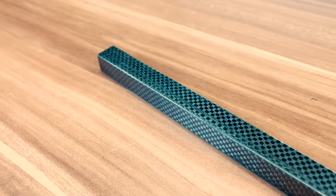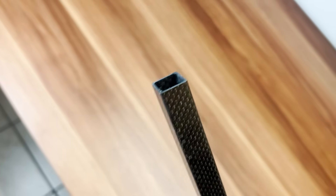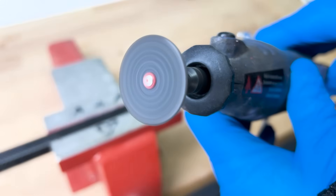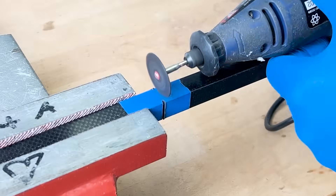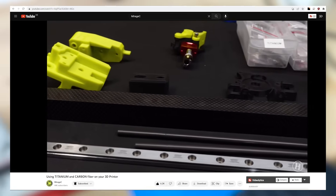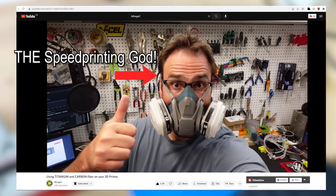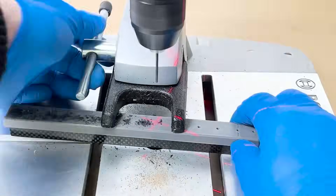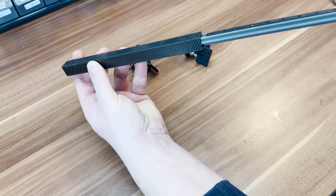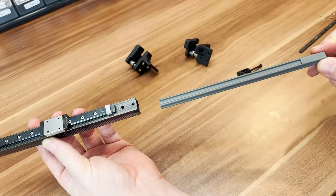When it comes to strength-to-weight or stiffness-to-weight ratio, carbon fiber composites are always worth considering for technical applications. As there is no ready-made commercial option for Voron Zero on the market, I built one myself using a 15x15mm square hollow tube with 1mm wall thickness. Make sure to check out Mira C's video on that topic. Most importantly, ensure to protect yourself when doing cutting work with carbon fiber. I designed some helpers for drilling and assembly, and used the original Voron Zero nut carrier for the rail mounting. Non-destructive disassembly is possible, which is mandatory in my case as I'm still waiting for my titanium fasteners from AliExpress.